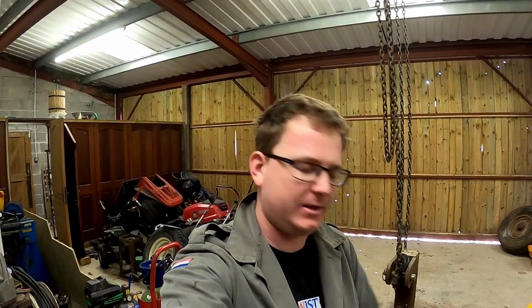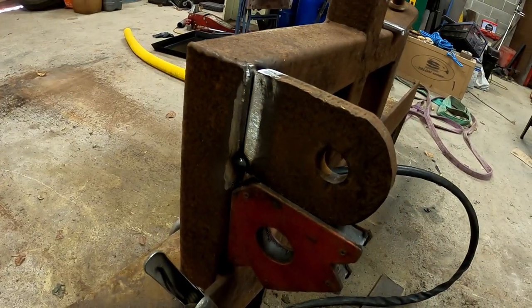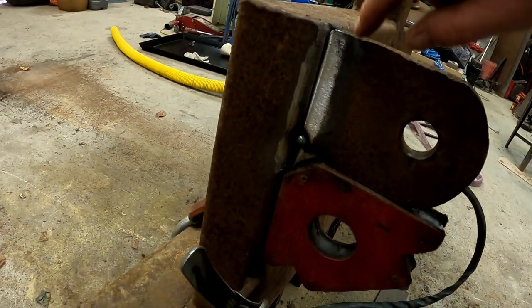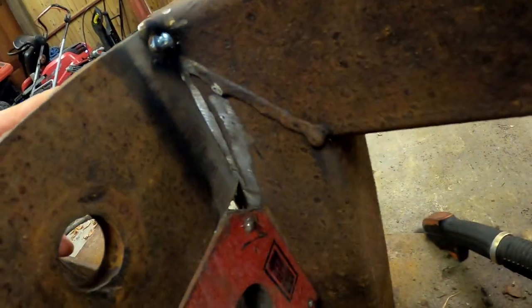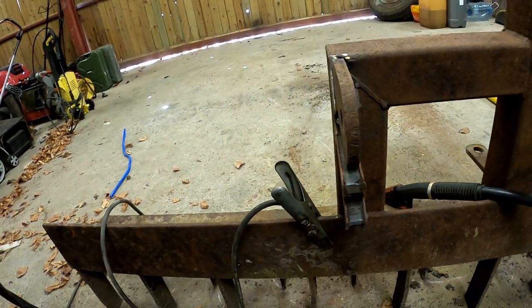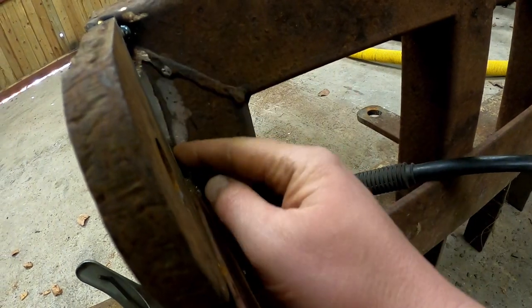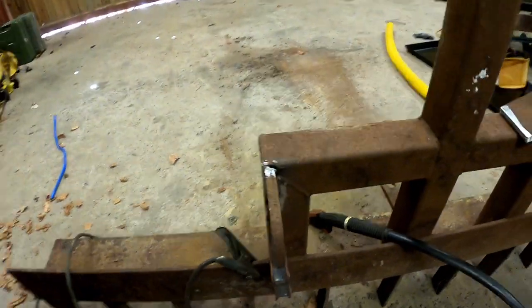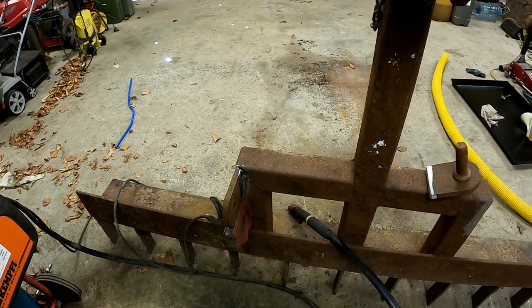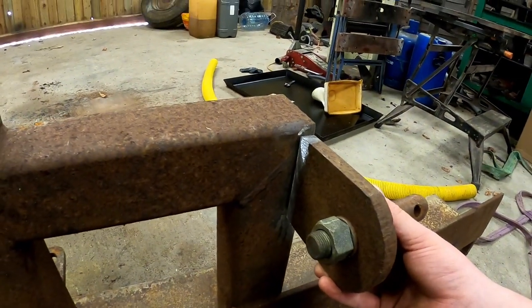I've changed into my welding jacket — it tends not to burn as badly as a nylon jumper. I've cleaned up the actual blade itself and added a 45-degree chamfer all the way around it, rather than the pure 90-degree fit-up it had before. I've put a couple of tacks in ready, and now it's vaguely vertical for agricultural work. I'll zip up and do any repairs needed. I'll probably run two welds on the inside before fitting the gusset — I'm unsure if I'll fit it but I think I might because I'm here. I specialise in overkill. Then it'll be the same on the other side.